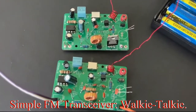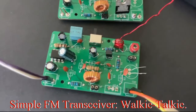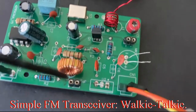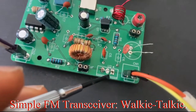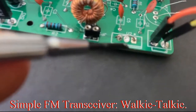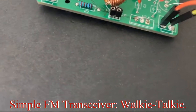We've made a little adjustment on one of the boards. For this board, we still kept the 5V regulator. But on this other board, we've removed that and used a jumper wire to connect from the input to the output — in to out — and left the ground open. Then just connect the power back.